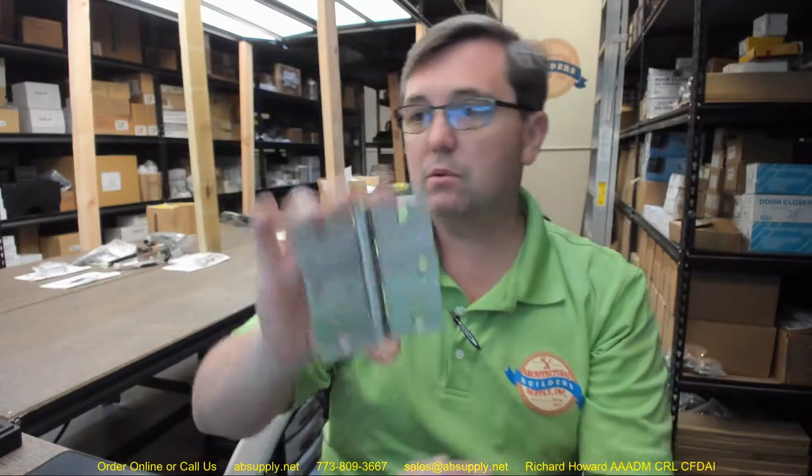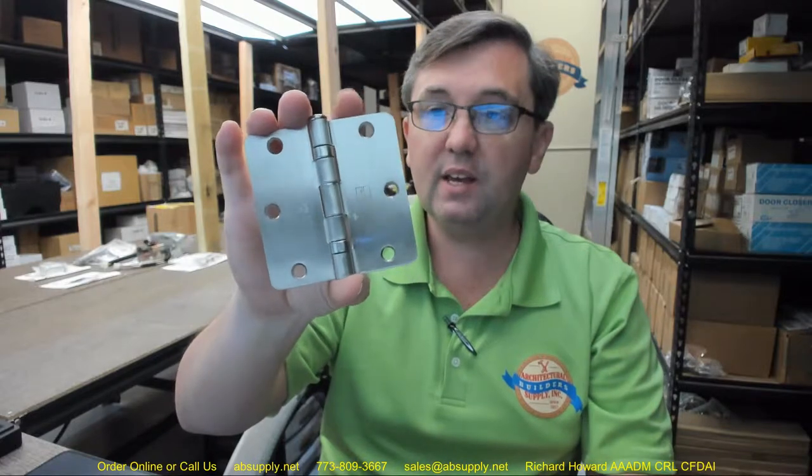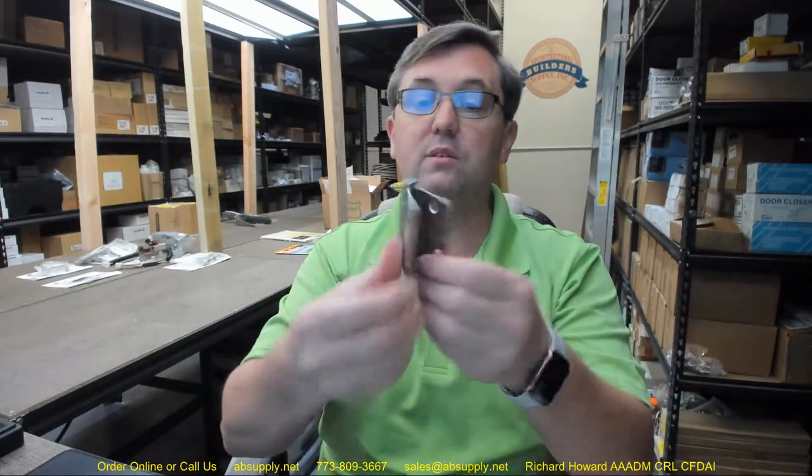Plain bearing hinges would be an RC1741 — those knuckles just grind on each other. That is going to work certainly, but 20 years later there is going to be substantial wear and tear on a hinge. I have even seen it after 5 years of heavy use where the pair of doors — a coat closet the family is into every single day — those doors are so severely leaning toward the center that they make contact, simply because of the grinding of the leaves against each other. They make the margins between the hinge knuckles so severe that the door hangs and sags.